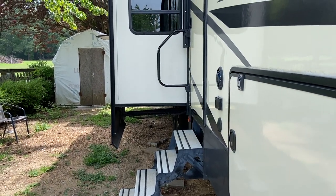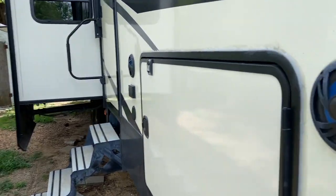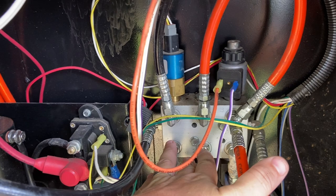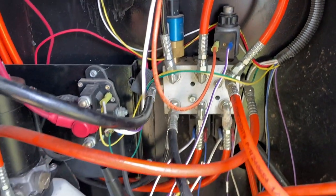It's going to take a lot of force to push that slide in — a lot. You're going to need multiple people. It's going to be extremely hard to push. But once we figure out the right valve, we can push in or retract whatever hydraulic system that we need to move. And then we can close the valve back and it should stay in place.